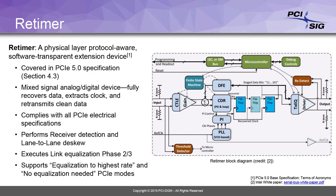They need to implement the receiver equalization process phases two and three to automatically train the link partner transmitter preset settings. They also need to participate in receiver margining so that you can read out the eye height and eye width from a retimer device. Retimers are also required to implement the no-equalization-needed and equalization bypass to highest rate enhanced link behavior capabilities. Finally, retimers also reset the lane-to-lane de-skew, which addresses mismatches in physical routing on the board, allowing you to drive another 36 dB without skew accumulating and degrading your link performance.